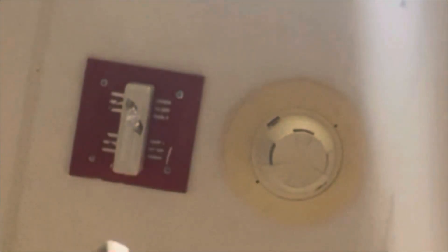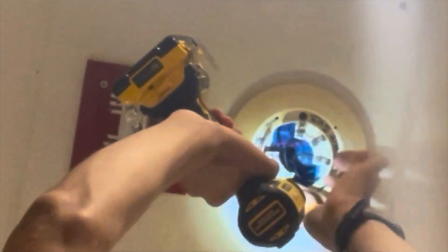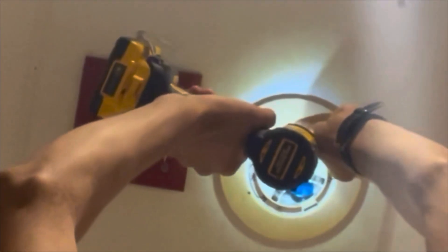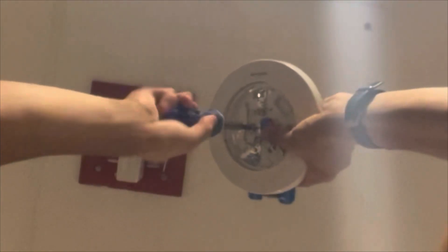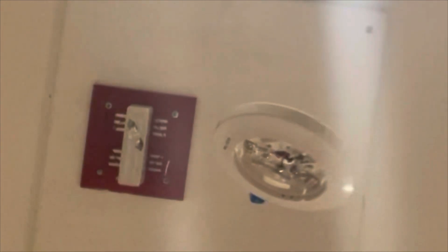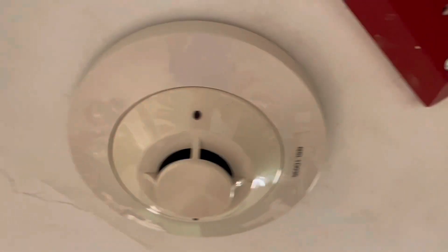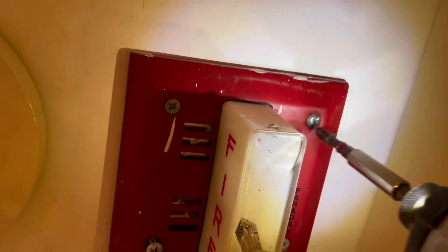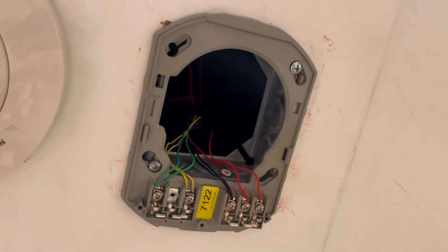This is going to get replaced. First I'll pull down this smokehead, go ahead and wire up the base, then slide this onto the mount and put in the next screw. Now let's use the impact driver to remove this horn strobe. The base is all wired up, so we can go ahead and pop this speaker strobe into the bracket and tighten down that screw.